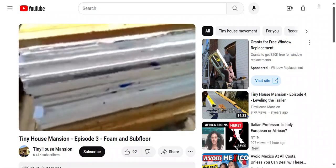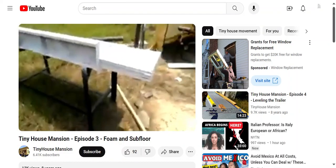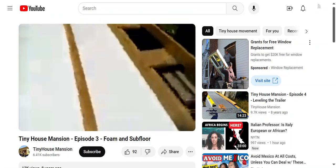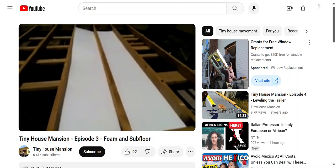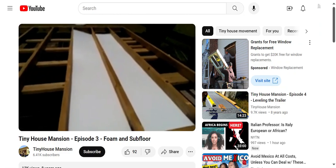I got all my lovely foam - it's a mixture of 3/4 and 1 inch pieces. Those are the 1 inch pieces, and I'm just cutting them to 14 and 1/2 inches down here for my foundation. We'll probably put about 1 and 1/2 inches down here. In Texas the climate really doesn't get too cold in the winter, so this is a wind and thermal block.